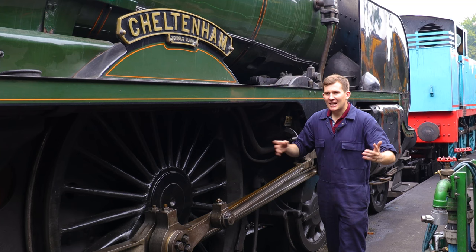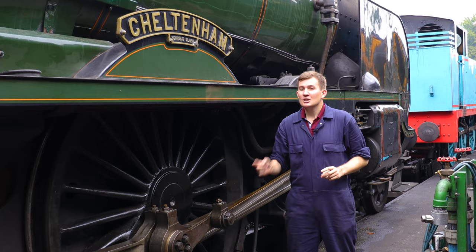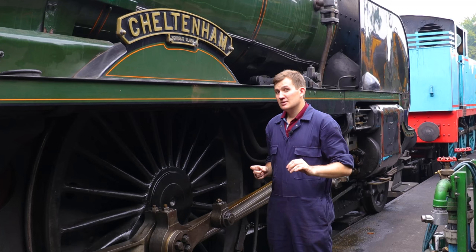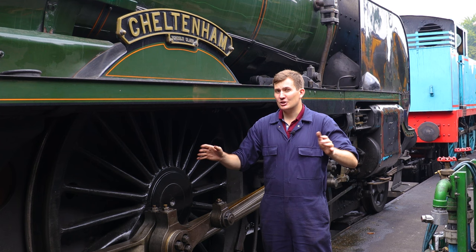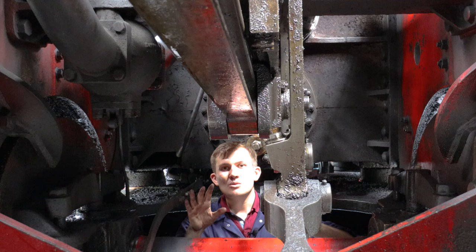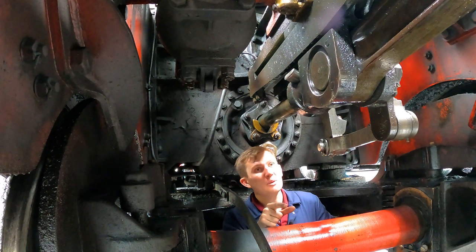In reality it's a lot more complicated than that and this video is far too short for all of it. But if you'd like to see just how a driver drives a locomotive and how a fireman fires it, we've already done a video for that — we'll post a link in the description below. Now pretty much all steam locomotives have at least two cylinders, one either side, but some like this one have an extra hidden away. We're now underneath the beast where all the motion is, and you can find this — a third cylinder — just like the two on the outside, and this provides drive to the main wheels.